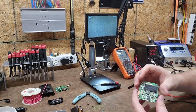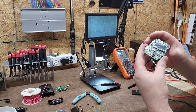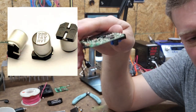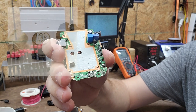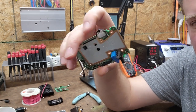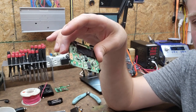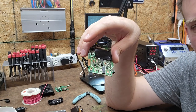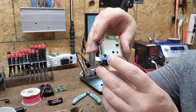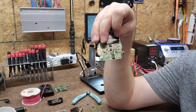One of the ways we could have solved this is instead of using these garbage electrolytic capacitors, they have solid capacitors which can take their place — those are military-grade capacitors meant for high heat. Electrolytics do not like high heat, and as you can imagine this device baking on the dashboard of my car gets really hot. It could easily be 140 to 150 degrees in a black case, and as soon as I turned on power to the input port it shorted out and created the kaboom.